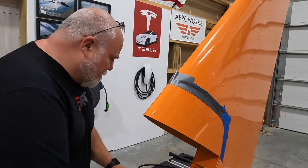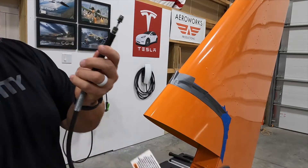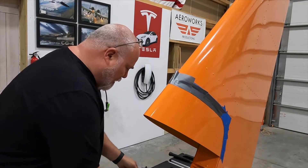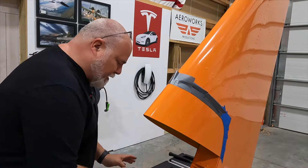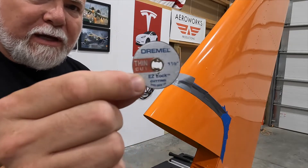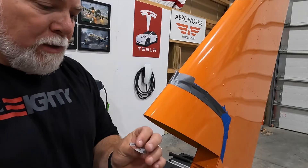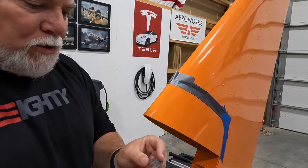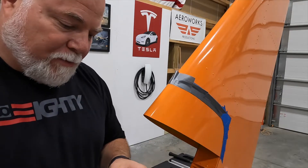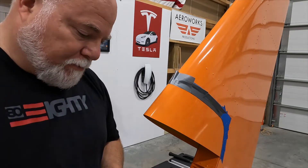About to get started here. I'm using one of my older Dremels — it has a flexible shaft so I can kind of steer this around like a dentist tool. I've got the quick release Dremel cutoff wheel attachment on there, and I'm going to be trying two different Dremel wheels: a thin cut and a Dremel metal wheel. We'll see which one goes through better. If the metal one goes through, we'll probably stick with that one because I have more of them. If the thin cut does a better job and doesn't break, then we'll use that one.